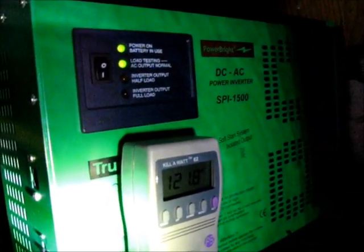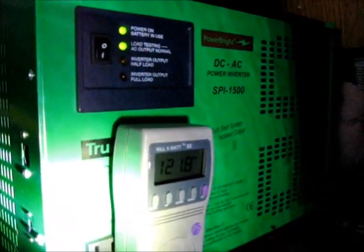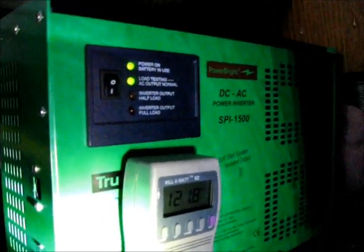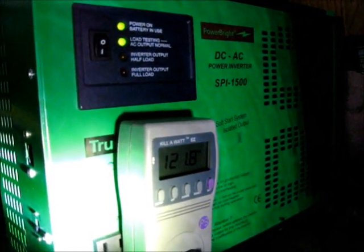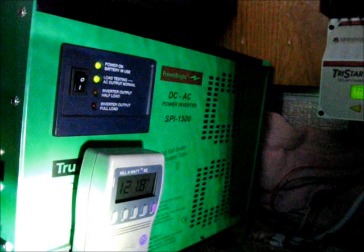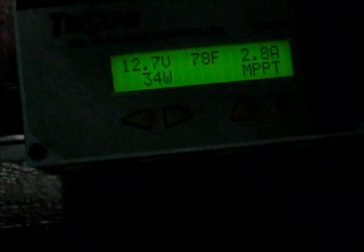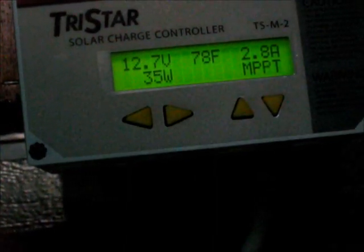And I'm thinking that it's got a low battery voltage that's too sensitive. I'm going to have to see if there's adjustments on my inverter, because it kicks the load at about 12.5 volts and my batteries are still full at that voltage. So actually I'm going to refocus this on the inverter or the charge controller and try it again. Now this is funny because I cannot see this, so I'm going to have to record it and look at it myself later.